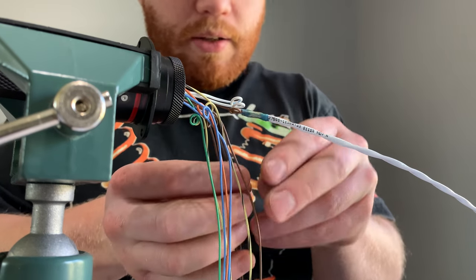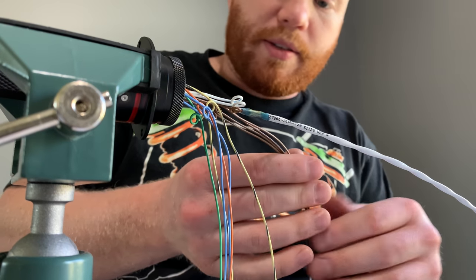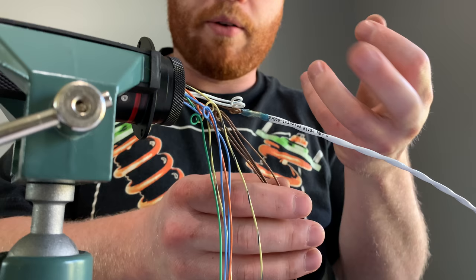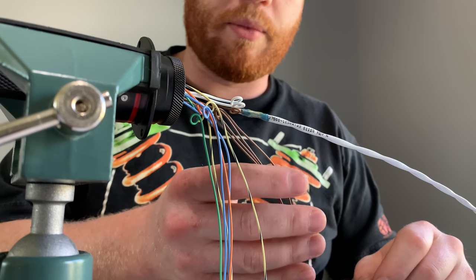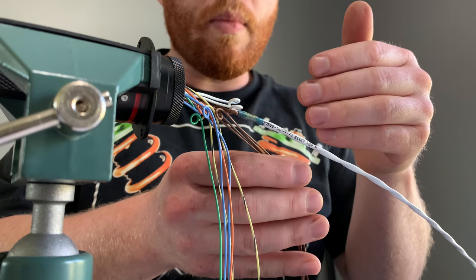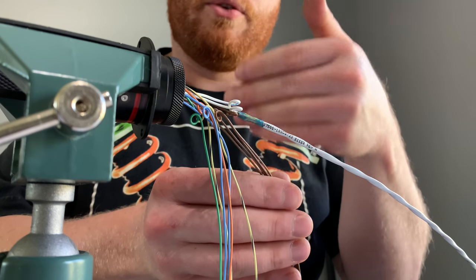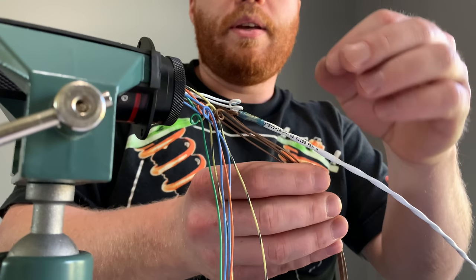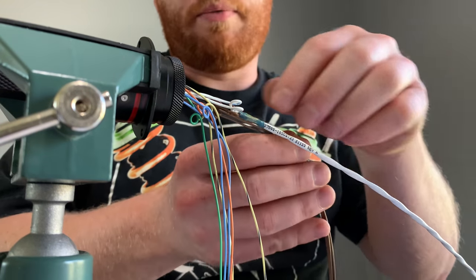So no big deal. What I do is I start with a couple wires. Normally if I had a single wire and seven other wires, I'd just start with all seven wires and start twisting from there. But because I have this single core, I'm going to use the method that I use on the next layers, where I am wrapping a few wires at a time.